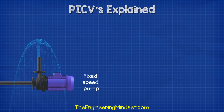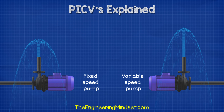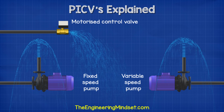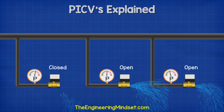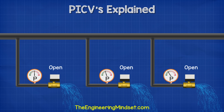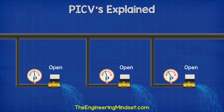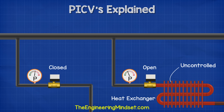In a hydronic heating or cooling system, we have pumps which boost the pressure and circulate the water. Some systems have pumps which vary their speed to change the flow rate and thus the system pressure. We also have control valves which open and close to control where and how much water is flowing through the heat exchangers. The problem we face is that as the valves open and close, and as the pumps increase or decrease their speed, the pressure in the system changes. Because the control valves are trying to restrict how much water is flowing through them, as the supply pressure increases and decreases, the flow rate through them is going to increase and decrease also — meaning we do not have control of the valve's operation or how much heating or cooling is being provided.